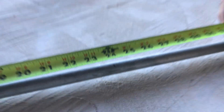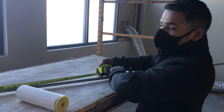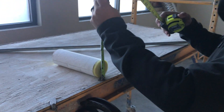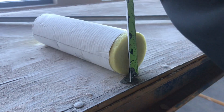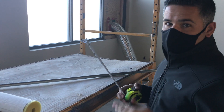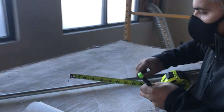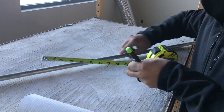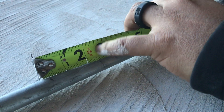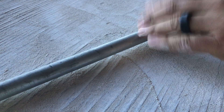So we have to add for our shrinkage — for every inch this goes up, we have to add 3 sixteenths. This is a 3-inch obstacle, so it is going to be 3 x 3/16, which comes out to 9/16. So that will be our shrinkage. Here's our little mark — go to 9 sixteenths, put our little mark there. And that's our new center.